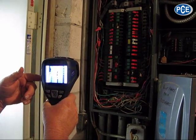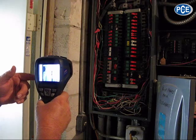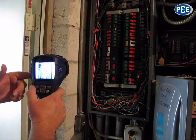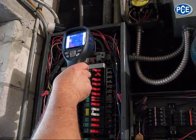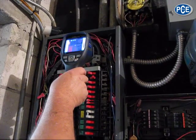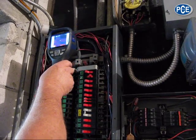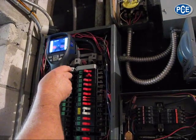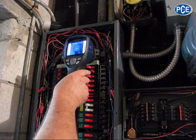This one breaker appears to be hotter than any of the rest of them — it's at 135 degrees Fahrenheit. I'm going to check it on the Celsius scale. It's not showing as much heat on this side, so that tells me the connection seems to be hottest at this point, which would be the most likely first avenue of failure.